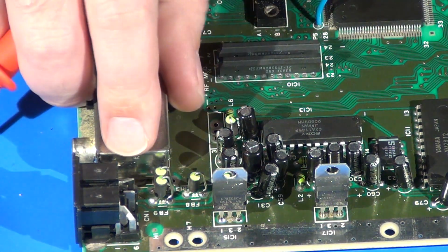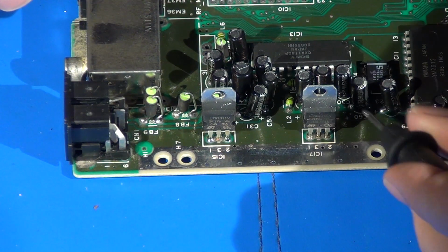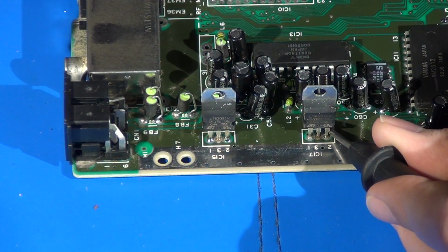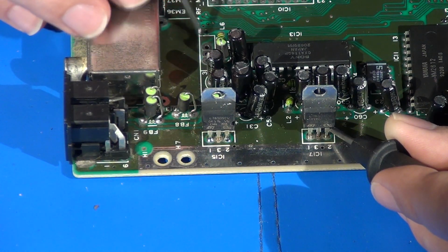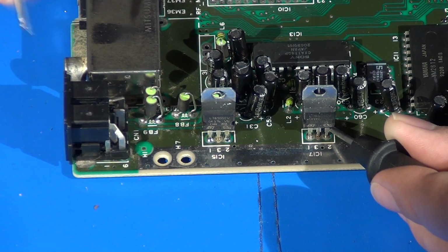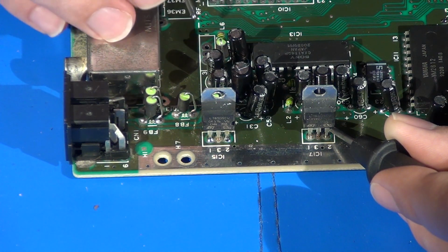And we can prove this quite easily by simply taking one probe in continuity or diode mode, whichever. In my case, I like the beep. There are actually 2 different RF line points on these main boards, and because of that, we've got a set of 3 lines or 3 points right here completely unused. And we've got a power and a ground that we can get from that quite easily.